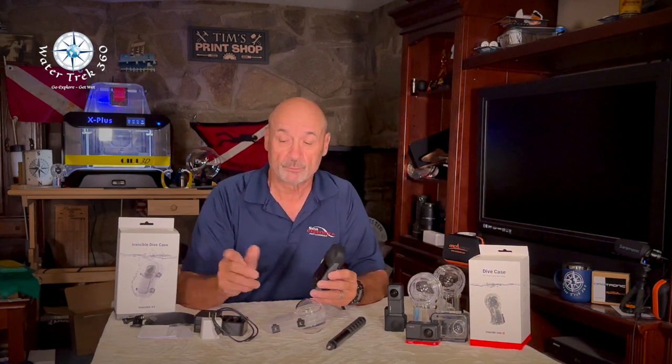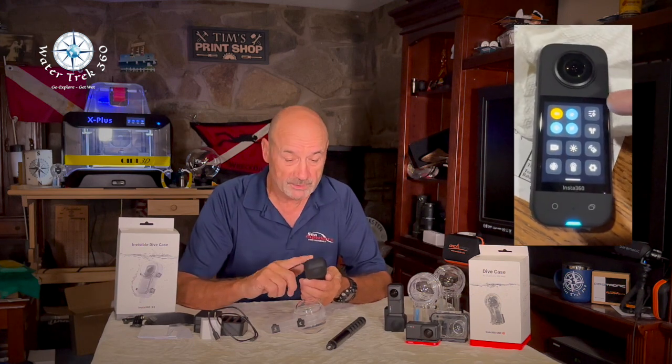Don't put it in a DCIM folder or any other folder — just add it to the card. They'll tell you to delete the old firmware bin, but if you have a new card there won't be one, so just ignore that. Remove the cord from the X3. The X3 will shut down automatically. Press the power button once — the X3 is on and it will begin the firmware upgrade. The screen will go black but the power light will still be blue. Once it's done, go back to Settings to check the firmware by swiping down. It should now show 1.0.8.